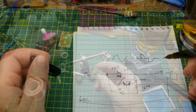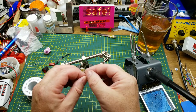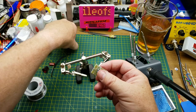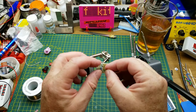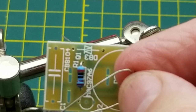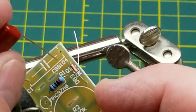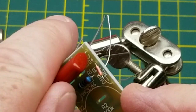Same effect. Okay, now that we know everything we need to know about this, let's get to soldering. Let's put in the resistor and the diac first. So this little 2K resistor just goes in here. And the diac, being a dual directional diode, doesn't care which way it goes. That symbol is slightly different than how I drew it, but it basically looks like two diodes going in both directions, and that's essentially what it is. Should I put the capacitor in too? Sure, why not? Again, it's a non-polarized capacitor, so it doesn't care which way it goes.